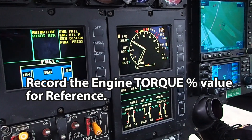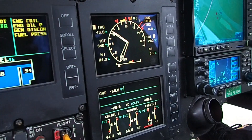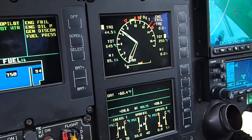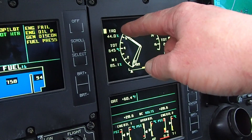The pilot is pulling up on the collective just ever so slightly with one engine so he gets N1 at 85%. Now that it's at 85%, we stabilize it for a little bit, and then we write down our torque. Our torque right here is 44.0% — that's our reference value before we switch modes.